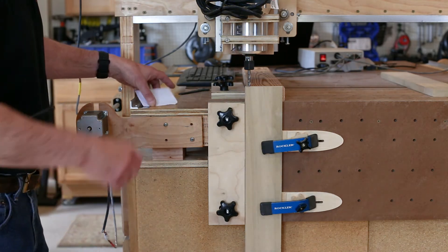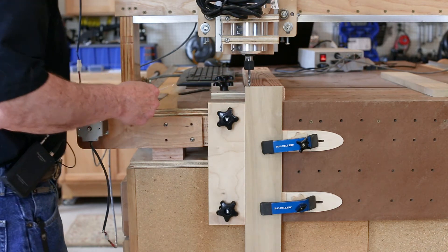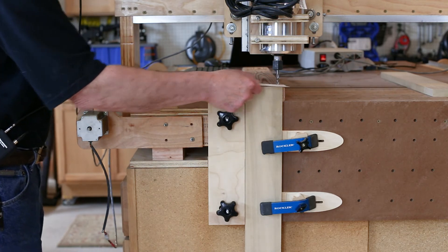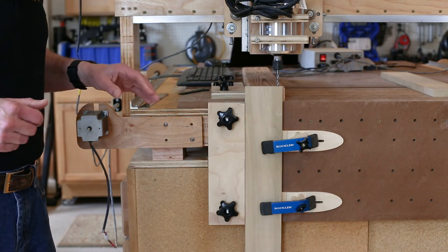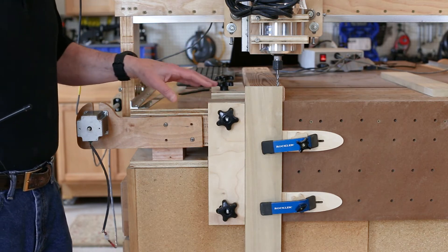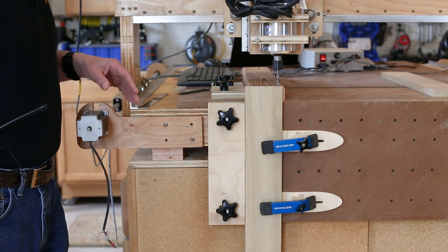Let me show you how I reconfirm that this is absolutely perpendicular. I zero out my quarter inch bit using a little paper shim to make sure it's perfectly zeroed, then run down to the other edge and use my paper to confirm I get the same feel there. So now I know I've got a good zero all the way across the top with my quarter inch bit — and that's going to be my workhorse. We're going to have one bit change: we use the quarter inch bit to cut the pins first, then hog out the center of the tails, then change to a dovetail bit and run it through the tails. That's all it takes to make these joints.